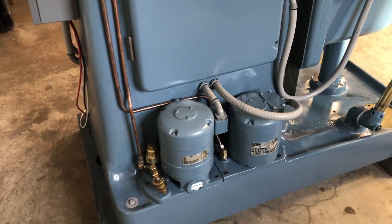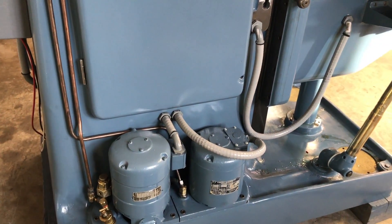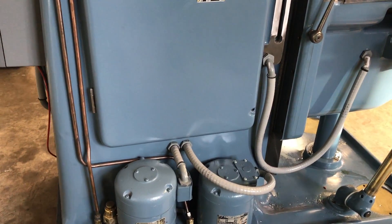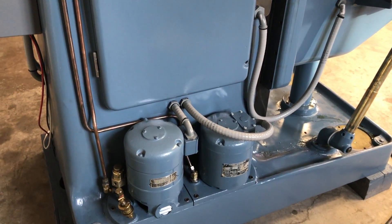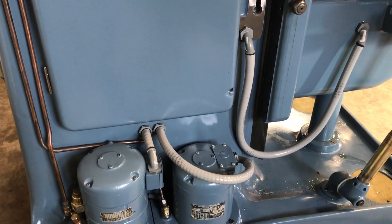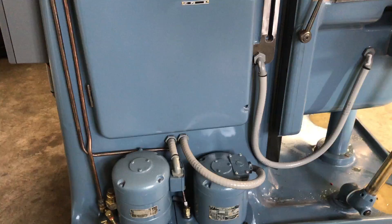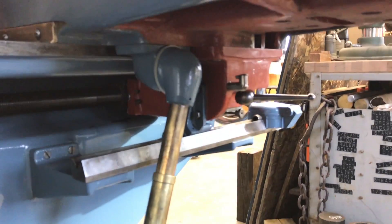It also has a coolant pump that was in really rough shape when I first started looking at it. I wasn't even planning on taking it apart — I was just going to sandblast it off and paint it with the rest of the machine and use it as a cover — but I started taking it apart and it was actually salvageable. It's somewhat of an internal gear pump. I don't think it would pump water-soluble oil very well — I think it's meant for pumping cutting oil — and it pumped 10-weight through it great after we got it all fixed up. All we had to replace was a spring and a check ball.